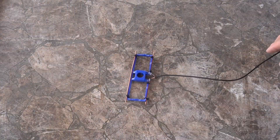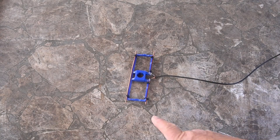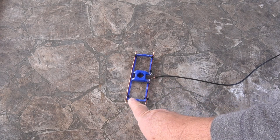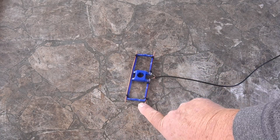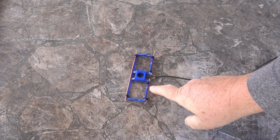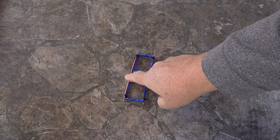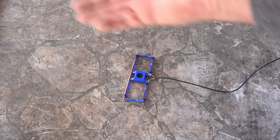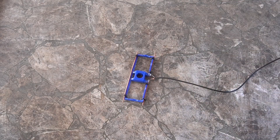This started out to be a little moxon project. The problem I have with the moxon is I made it smaller — it was too big, too long. As I cut things, the distance got off because the stop marker is hard to see, but that was what the moxon calculator said to use. So I turned it into a dipole first, then added a second one just to see if I could get it tuned in — about 1.3 SWR, pretty good, and that was five or six feet off the ground.